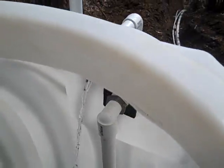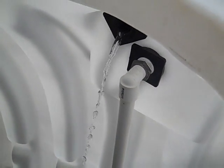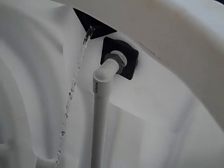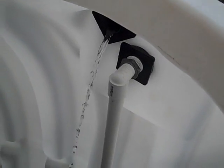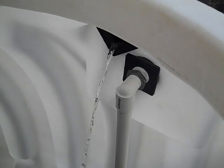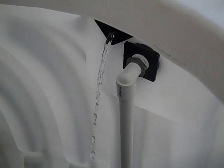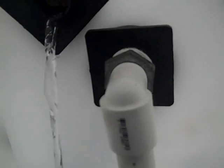We're back backfilling some lines from our 1,700-gallon tank and you can see the water coming in — and that is without electricity. The pump is 110 feet below us in elevation, about 800 feet away, and it's doing its job. We just calculated about 0.57 gallons a minute — about 800-plus gallons a day. I'm adjusting and fine-tuning the ram to the spring output. Anyway, listen to that sound — it's the sound of victory.